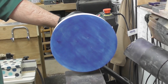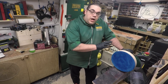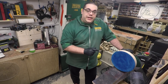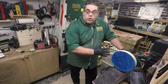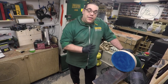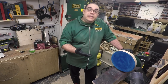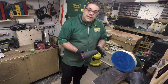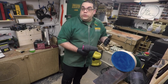Okay, and there we go — that's it coloured. Pretty straightforward. Now you want to leave that to dry for a little while before you do anything else. I should just point out that apart from sanding — and I very much recommend only dry sanding, don't use any oil or any abrasive paste — nothing else has been done to that after the tool left it. You don't want to put any sanding sealer down or any oil at this stage. Because this is water-based it will take a little while to dry, not long, maybe a couple of minutes, but we can speed that up with a hairdryer. I've got a standard regular hairdryer here — put it on a low heat setting and what's really important is don't focus it on one particular part of the piece or you could end up with the wood splitting.